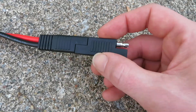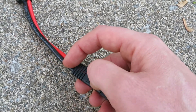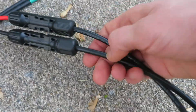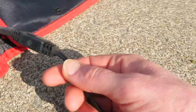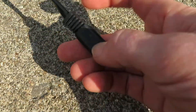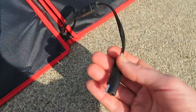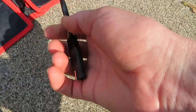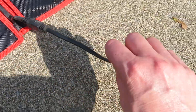They send you this little plug in case you need to change the polarity, because red is normally hot and black is usually ground or neutral. Unfortunately this cable is not color-coded, so I don't know which one's red and which one's black. It helps to have a meter — you can just hook it up and open the panel and it will tell you which one's hot and which one's ground. But I'm going to show you that you can do it without a meter.